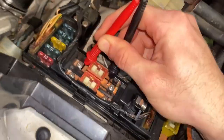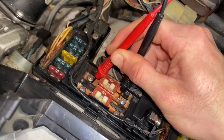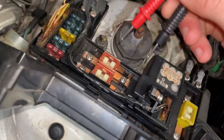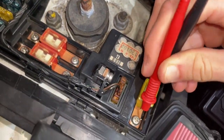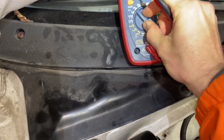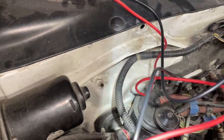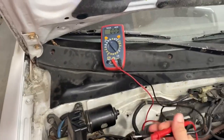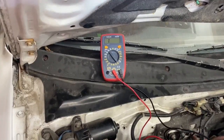And you can see again that this is telling us we've got basically zero resistance between these two points across the fuse, which means our fuse is good. We can check these even if we don't have bare contacts. Alternatively, you can also go back to the audible continuity tester and verify that these things are good. That's going to wrap things up — I hope this is helpful. Thanks for watching and be well.